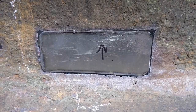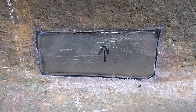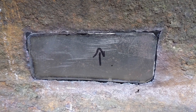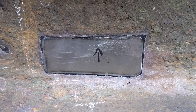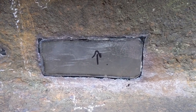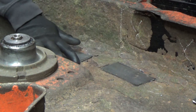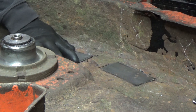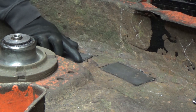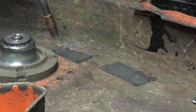The more that I cut and grind away, the better these pieces are fitting. I've put a little arrow on the metal so that lets me know that is the inside piece and that it faces up - that way when I come back from the bench grinder, I don't have to rotate the piece and guess where it goes. I got the magnets set up underneath. I'm wearing my thinner gloves just so I can feel the edge because I want to position it to where it's nice and flush, so I should be able to go ahead and tack this into position.